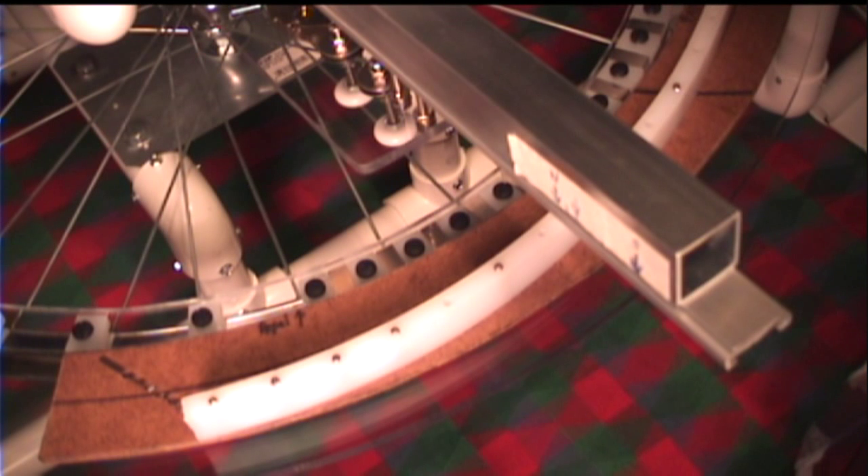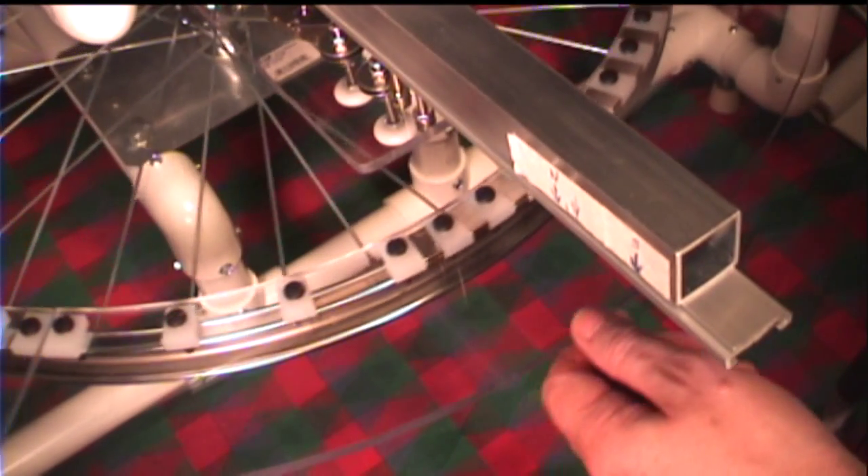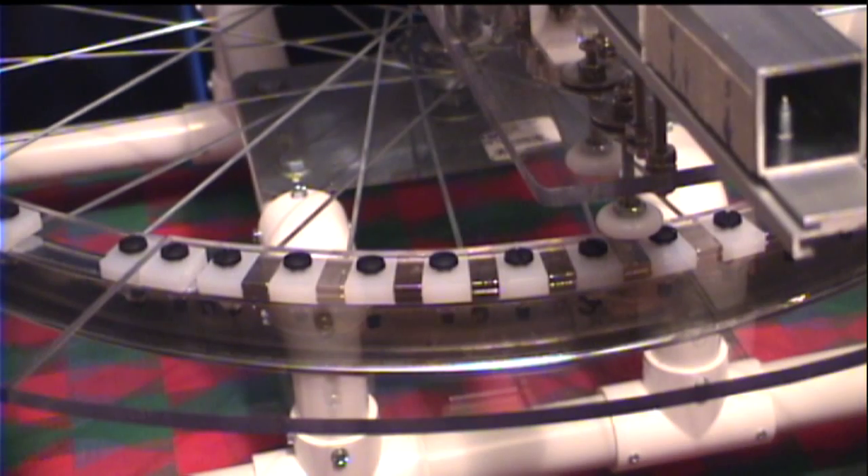Basically what this tells us is that we can't move the stator carriage one inch as we progress through a rotor group. In fact, it would be best not to move it at all while we're progressing through a rotor magnet group. It looks like any movement is going to have to take place at the tail end. It's quite evident that we're definitely not going to be able to get any good movement while progressing through a group — I've already demonstrated that with the experiments.